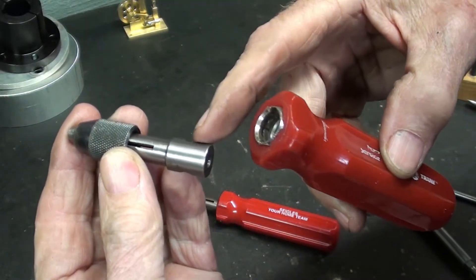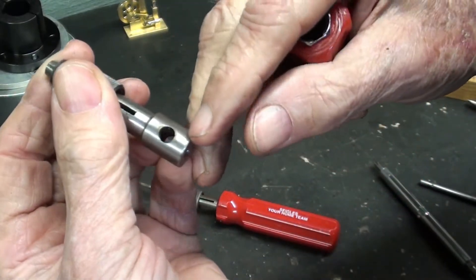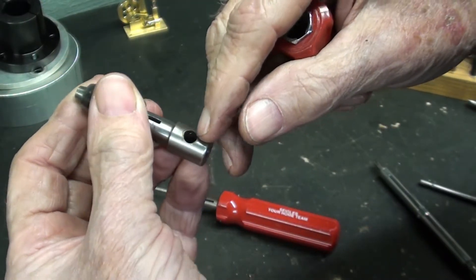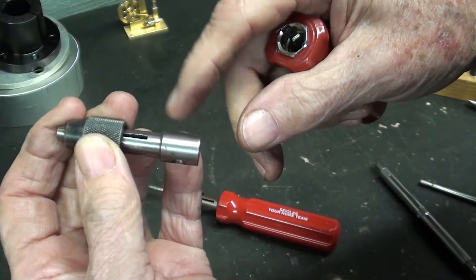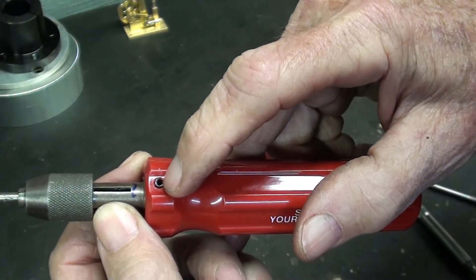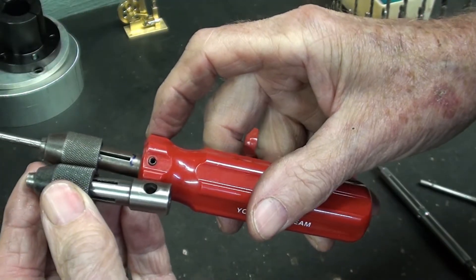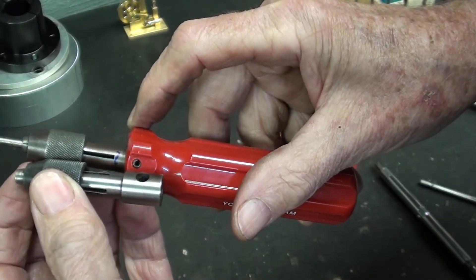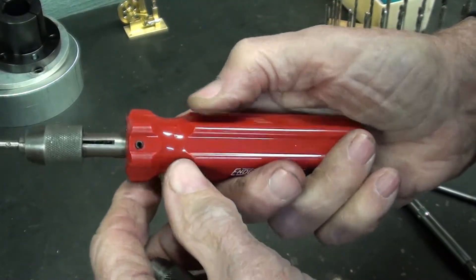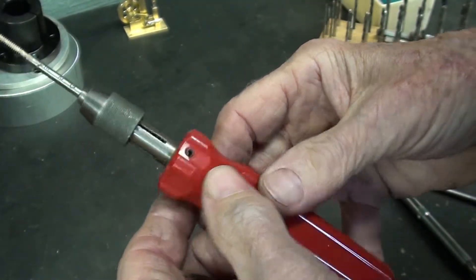I haven't turned this one down because I don't need another one, but you need to determine or remember where the hole is, because you do not want to drill the hole for the pin and have it interfere with the large hole here. What I did is I measured and laid it out, and that is why the pin is relatively close to the end. I drilled an eighth inch hole going all the way through — never use a pin in a blind hole — and that's just an eighth-inch roll pin that is one inch long.